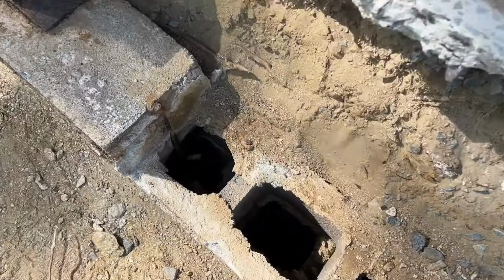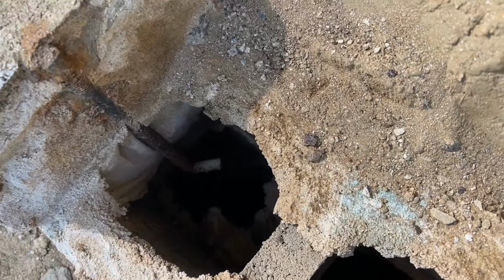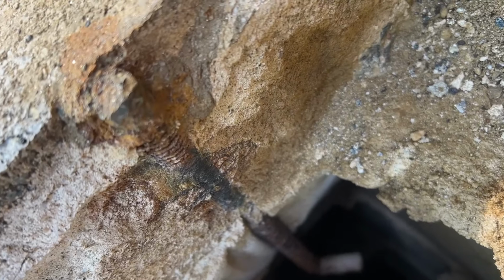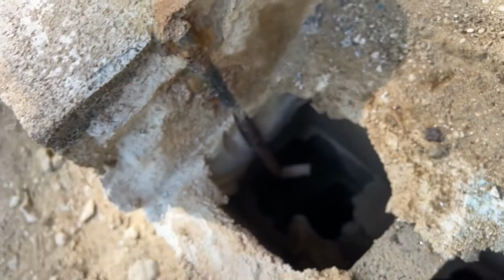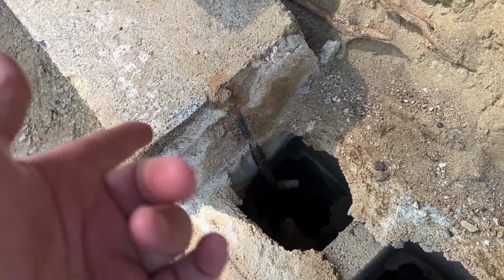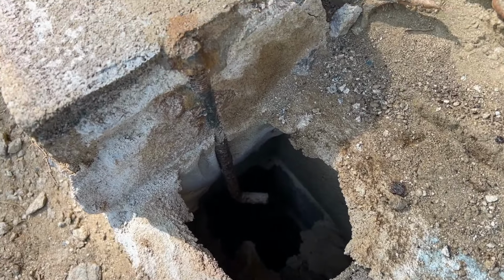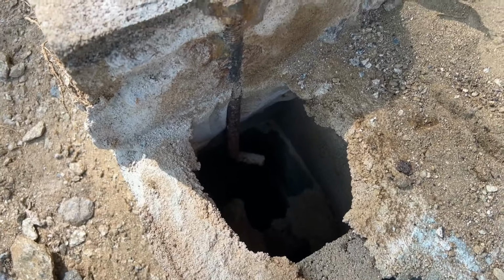I mean, you didn't fill the core in, bud. So what is that J bolt doing? What are we doing there? What are we doing? Shoddy threads? I mean, you're supposed to drill the plate, stick the plate on there. Couldn't handle it, huh? Look at that, it's doing nothing.